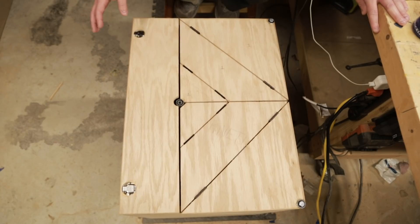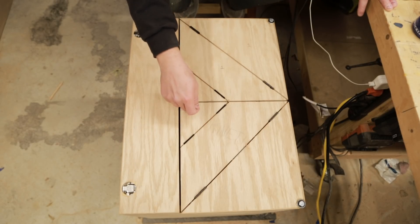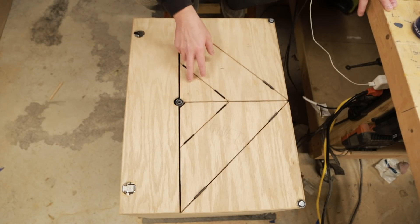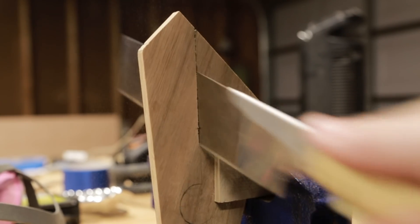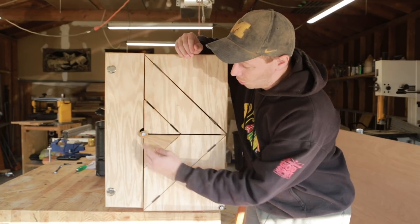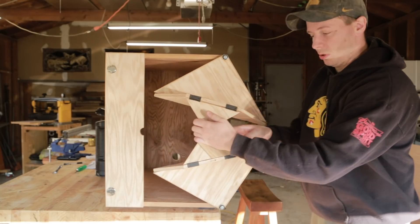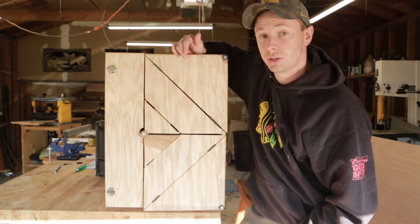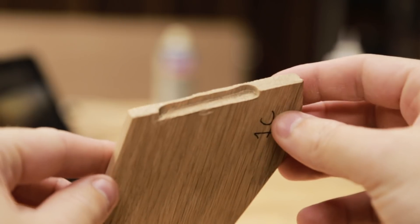Good thing we're putting those mosaic pieces on top because that'll cover up where the hinges poke through. With the mosaic pattern, I have a bunch of pieces, but I need a piece that attaches to one panel specifically but not to the other, and it's going to attach with a bolt going straight down through here. That will cause these door sections to be fixed together but also able to swivel around the axis. After I cut that piece out, I was able to glue it onto the door and then attach the top and bottom together by putting a bolt through. There was a lot of cutting of these pieces because I had to be aware of the gaps between the shapes as well as the hinges. To account for the hinges, I used my Dremel tool to scoop away the area for the hinges to sit in.